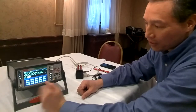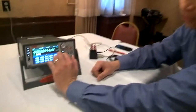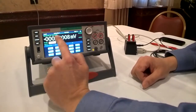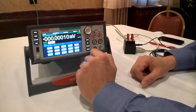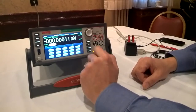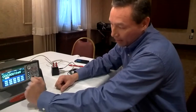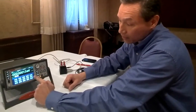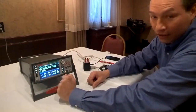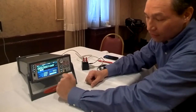Auto. Very simple to adjust. Now we split the screen into your measurement on the top — we list what you're doing there: DC voltage. We also list some of the typical indicators, such as your input impedance and that you're doing an auto zero. This bottom half of the screen is a swipe screen, so you can swipe and go through different DCV settings. Swipe again to look at statistics on this measurement.